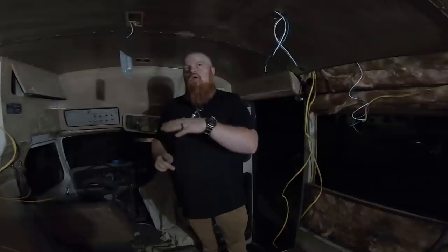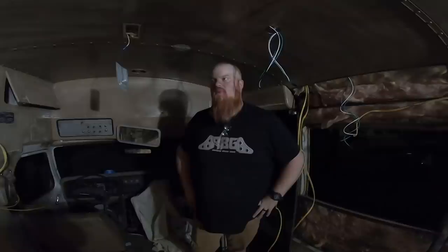And then we're going to also daisy chain into that to our TV power. So basically five outlets are going to be run off one breaker, then another breaker will power just the refrigerator, then another breaker will power just the AC unit, and then another breaker will power our water heater, and then another breaker will power the lights.